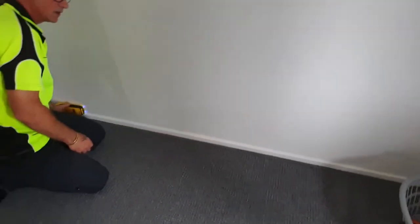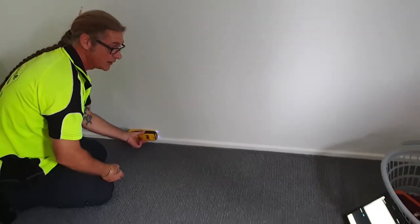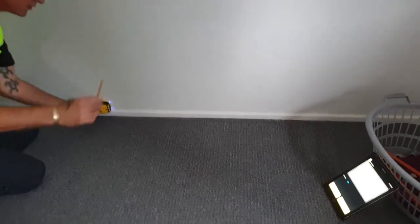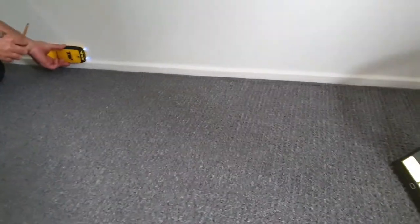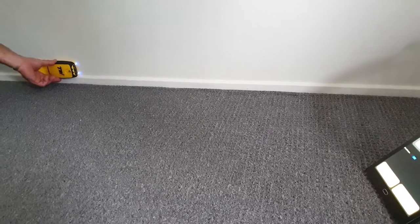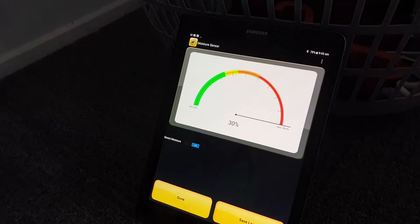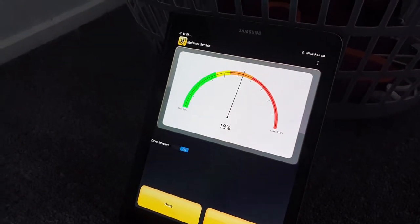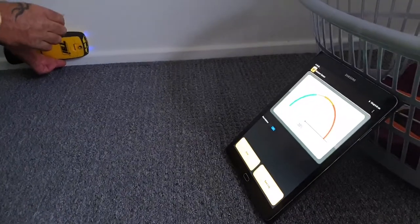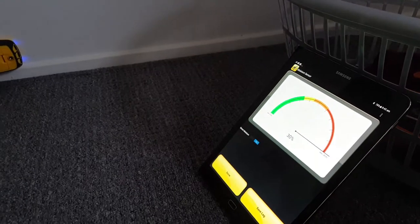I'm just down low — that's not an unusual sort of figure for where I'm located at this time of year. Now we're starting to climb up, so all we're going to do is roughly in this area where it is altering, just put a little pencil mark on the wall. I'm still going along — see, that's elevated moisture. Now we're just starting to break off, so just generally speaking, just another pencil mark.